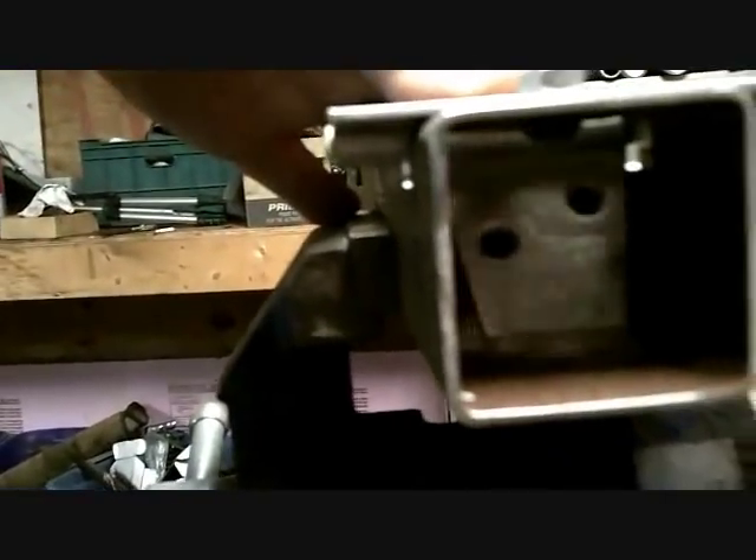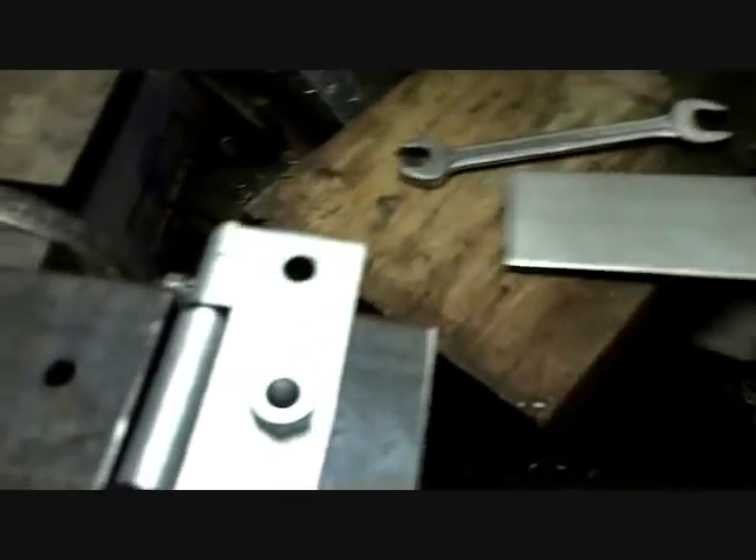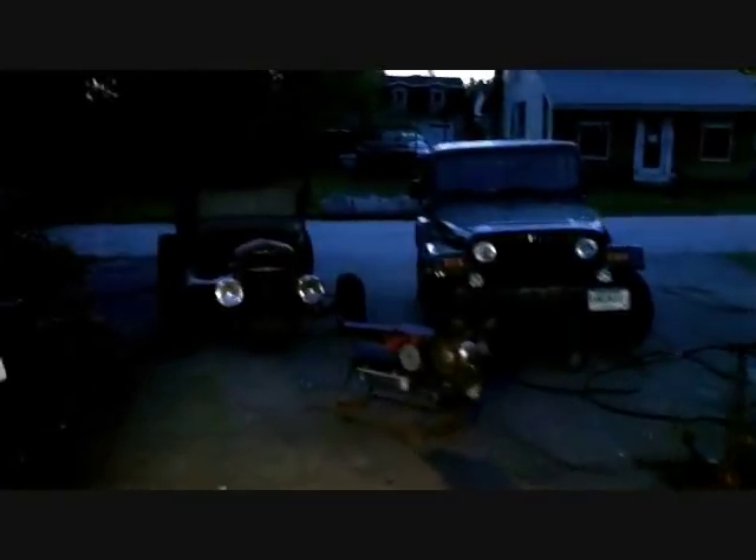This was an idea — reverse the hinge. It's a little three dollar hinge, which they want nine bucks for two of them. This can actually work. I'd beef this one up — it's only an eighth inch little plate and they have nylon between them. I might have to grind the end of the pin and pop the pins out, take the nylon out, do any welding, then put everything back together. If I can keep these straight top and bottom, which would be really easy compared to the other hinges, this should work. I tried and tried and tried — it's not easy, guys.